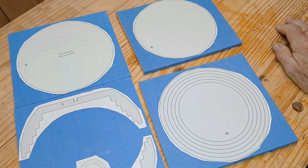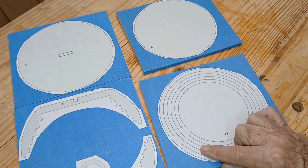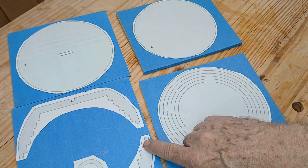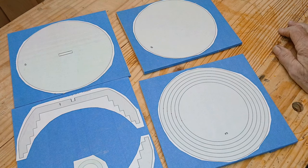This is a stacked basket with gaps between the rings, and the rings are a little bit narrower than quarter inch, so there'll be a slightly larger gap. These are like half inch — it should be a quarter inch gap between the rings, but I'm going to have a little more than that because the rings are going to be a little thinner. Not a lot — maybe a sixteenth of an inch.